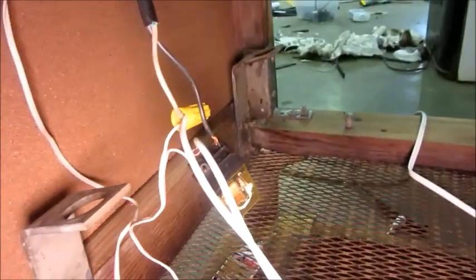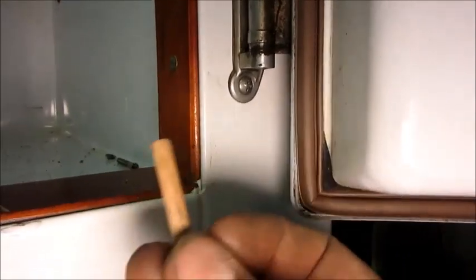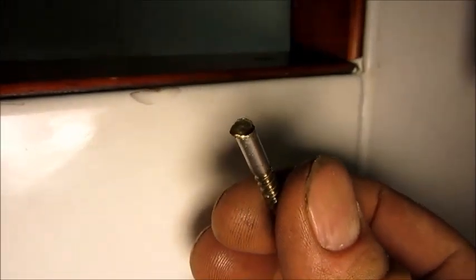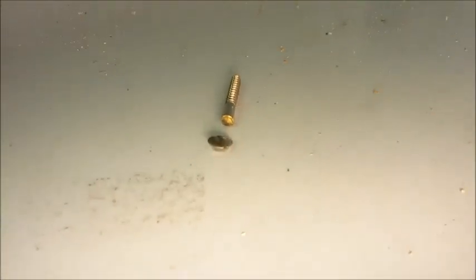Tomorrow, hopefully, the correct permanent relay will be here for the light — I just put that in there to demonstrate. It's going to be hidden up in this corner under a wooden cover. As far as these hinge mounts go, I drilled a 7/32nds hole, I think, tapered the end of a quarter-inch oak dowel, and drove it in there with super glue on it, then cut it off flush and re-drilled the hole. I took still pictures which I'll post explaining how to do that. This is why I'm not reusing the screws that came out — nothing looked wrong there, but as soon as I tried to unscrew it, it just broke off. Thankfully, there was enough of it left sticking out to pull it out.